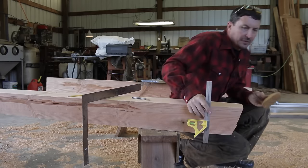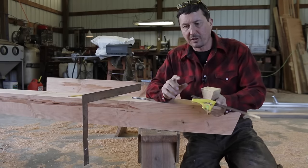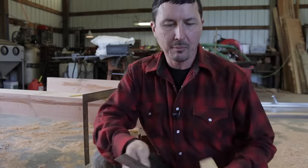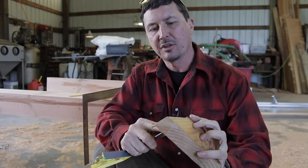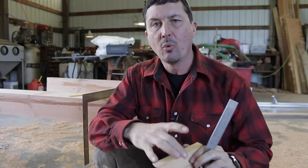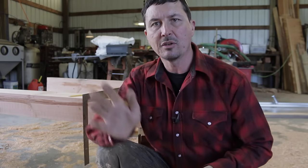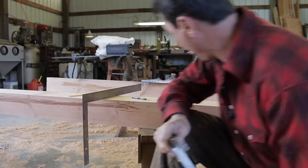My subscriber Arfwind asked about full dimension timbers. Full dimension lumber is material that actually is what it says it is — a full dimension six by six measures a true six inches by six inches. The stuff at lumber yards is typical framing material; a so-called two by six actually measures only one and a half by five and a half. It started as a two by six rough cut, but after milling, jointing, and planing, they bring it down to that smaller size.